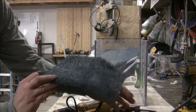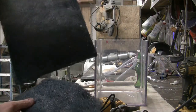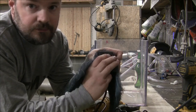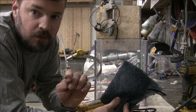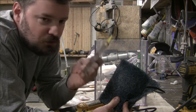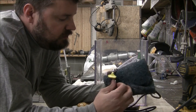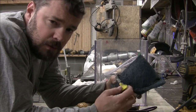I had this cut-to-fit filter material. You can see the white stuff on it - it's actually drywall dust from when I put it in front of my big fan doing some demo work. I cut a chunk of it off and I think I'm just going to wrap this pump with it. I've had these hose clamps here forever - I knew I'd use them one day. I'll just put this on there and clamp it down just to keep the small particulate and the recycled coolant out of the pump and make it last a bit longer.